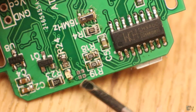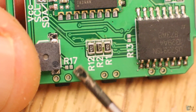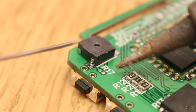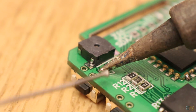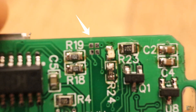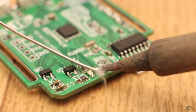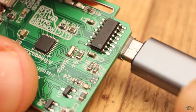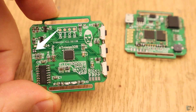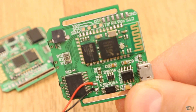On the board you will also see some very small pads — these are connections that can be made with solder. We have one for the buzzer, one for the RTC supply and two for the RX and TX pins of the Bluetooth module. If you want the buzzer to be connected, make that connection between the small pads of R17 using some solder. Do the same for the real-time clock chip on R13, but don't make the connections for the Bluetooth module yet. If the module is connected to the RX and TX pins, we can't program the chip — that's why I've placed these pads. So we program the chip, disconnect the USB cable, solder the pads and we are good to go. If you want to reupload the code, desolder these connections, upload the new code and reconnect them. Or if you don't want to use the Bluetooth module, just don't make the connections at all.